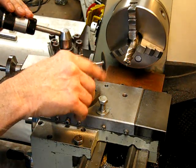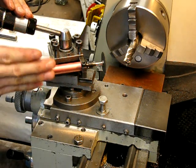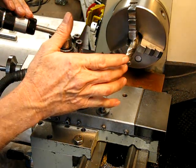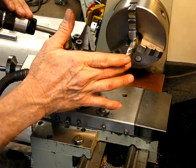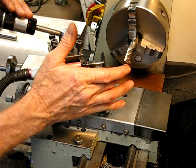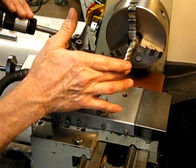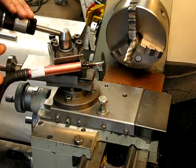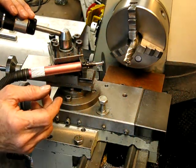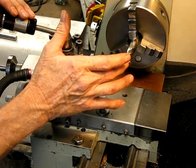You've got the disc above centre. You now have to set your compound mount at two degrees off 90 so that you're actually grinding into the centre slightly. You've got to have a slight V in the end of the end mill. If you look at any high speed steel end mill, you'll see they're not dead flat — they have a bit of a taper inwards to give them some clearance and to make them bite and self-centre better when you're plunging. You can't just grind across and spin it around; it has to have a taper in and you have to have the relief.